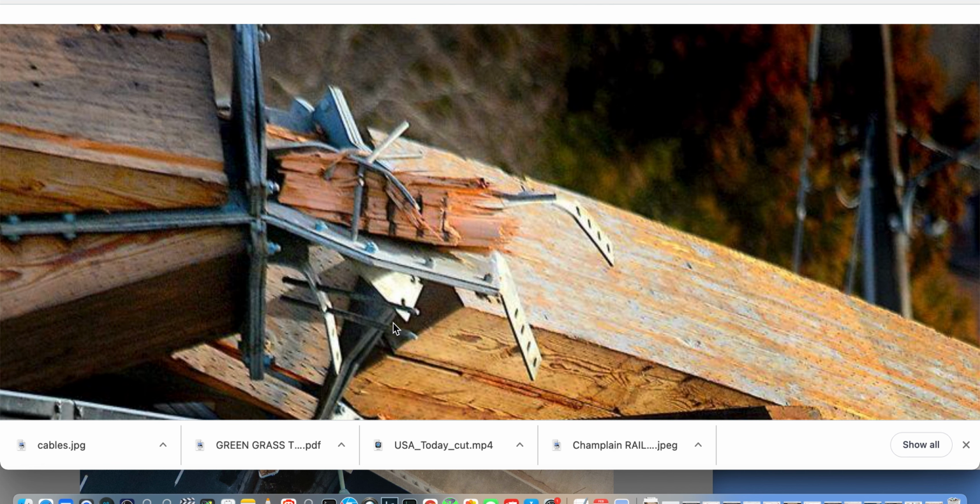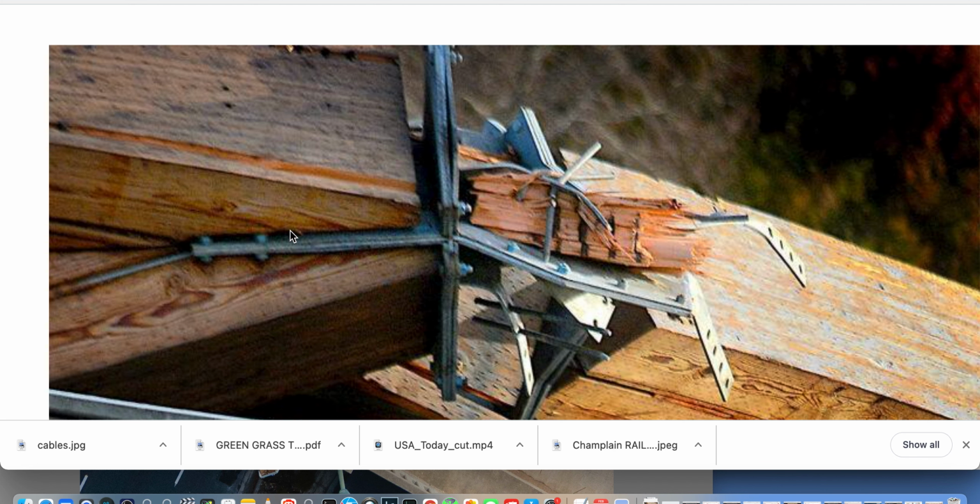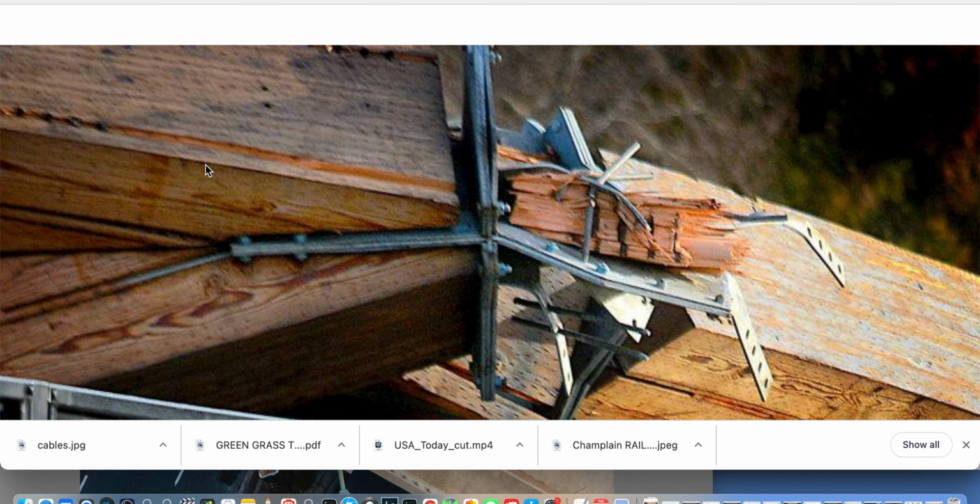I mean, they may be screws, but they look like just giant, there's an angle turn one. Oh, they put them in the same plane. You guys know how I feel about this? When you put bolts and screws and any anchors in the concrete all in the same line, that's a good way to create a shear plane. And look at that. We got all these anchors here in line. The one to fracture, the one to fail, it shows that as the weakest point because it's dissected. It makes a construction joint, a control joint. That would be this one over here, I believe.